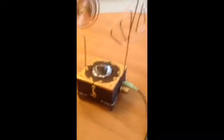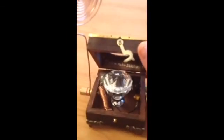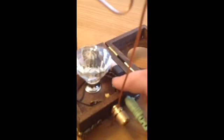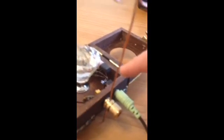It's in its experimental stage and it's looking pretty cool. I'll give you a quick glimpse of what's inside without breaking it too much. In there, if you can see — I created a coil to try and get a bit of a reverb sound on there. I've signed the back when I've finished building it. If I flick round — you've got your loop stick antenna there, and underneath that you've got your variable capacitor which tunes it. There's a glass germanium diode, which the light lets in to affect it with sound. You've got your resistor, and there's a small capacitor under there. And that leads out into this, which gives me the sound. So it's basically an amplifier, picking up all kinds of different weird signals.